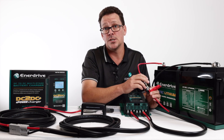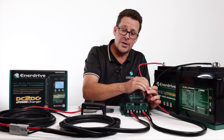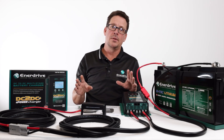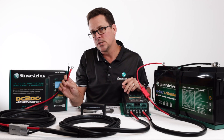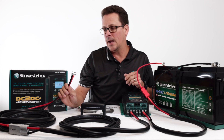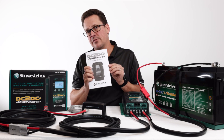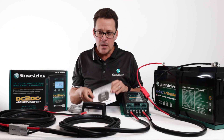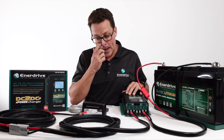A good quality fuse — whether a midi fuse in a Bussman holder, a Blue Sea safety hub, or a circuit breaker (no auto-reset) — is recommended here. On cable sizing: as a guide, we recommend 16mm² cable as the smallest, which is also around 6 B&S. Six B&S is normally around 13mm², so 6 B&S or 16mm² squared cable. The manual has plenty of information about how cable run length relates to required cable diameter. Sixteen millimetre or 6 B&S is the smallest we recommend.